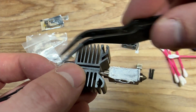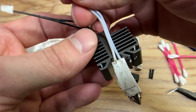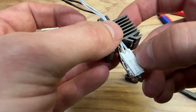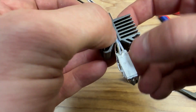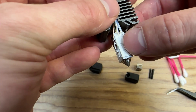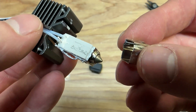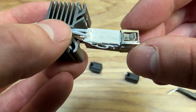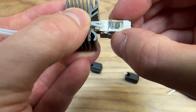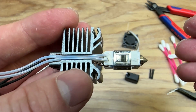The thermistor is in, and we've routed it up the side. Now put the ceramic heater just down to that groove — there are some locating features in the hot end, which is nice. Those are both in. Then put the clip on: the clip has a little tab on the front and reliefs on the side to allow the thermistor to have room. Just slide that on until it won't go any further — don't push too hard.